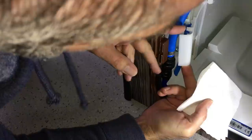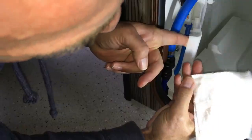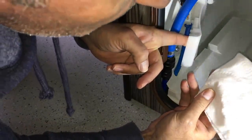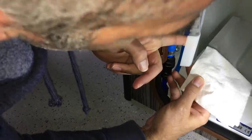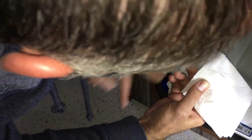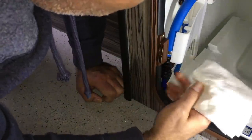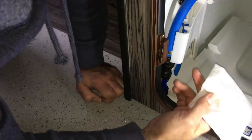I've pumped up the system, the pump's gone off, we're up to full pressure — about two bar. Just running a bit of tissue around the back here to make sure that is sound, and there's nothing on that tissue. The pump's just cutting in again to build up some pressure — there's a bit of air in the system until we bleed it all through. It looks like we've cracked it guys! I can't tell you how pleased I am — that has been stressing me out something rotten for the last couple of days.